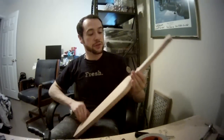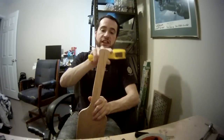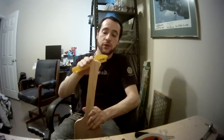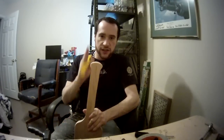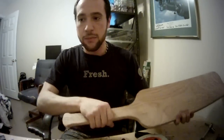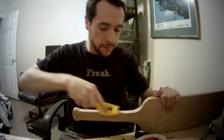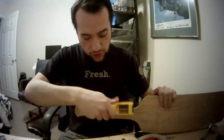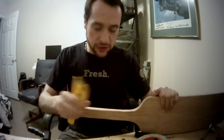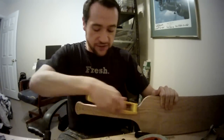A lot of our lines have been really smoothed and sanded out with more even consistent strokes. That whole process was just simply slowly shaving it down — it's a long and tedious process. I did actually mess up on the pommel, but I think in the final version it's not going to matter too much. The next stage is going to be the carving stage. I'm going to be carving back this handle to be a little more oblong and fit better in the hand, just by rounding off these edges pretty substantially. Same exact motion — long strokes, slowly trimming down this wood. With a scraper like this you might have some rough edges, but that's where we come back and sand to fix that.